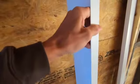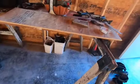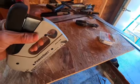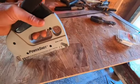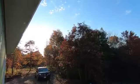The aluminum fascia goes on the outside and holds up the F-channel. Now, I didn't have a ton of roofing or siding nails, so I put the soffit up with a staple gun — I would never do this on long pieces of soffit or siding. But these are like eleven and five-eighths of an inch pieces; they're not going to grow and shrink a lot. They've got about a 10-inch span, they're held by the F-channel and the fascia, and the staple just holds them in place. It was really quick and easy.